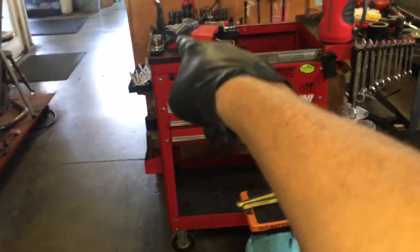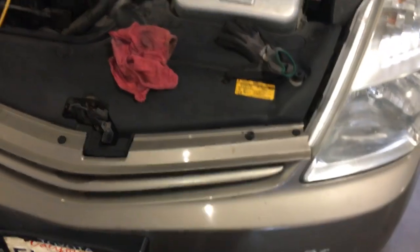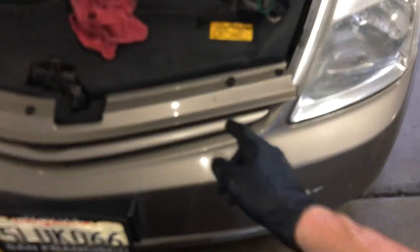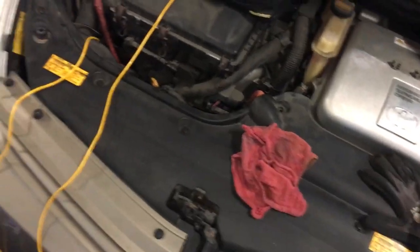You used your UV dye, your Stratus leak detector, your ultrasonic, your soapy water — and even after all that, you find no leaks anywhere and you tell the customer they're okay. But why was it low in the first place? There was a leak. You fill it up and tomorrow they call you and it's empty because it just opened up and released all the refrigerant. And guys, I've caught that on video before and shown you.